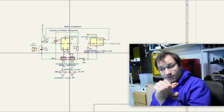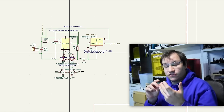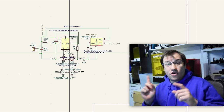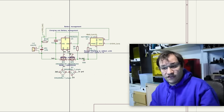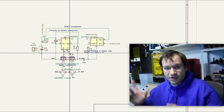The charging circuit is the same one we've used in countless other designs because I know how to build it, I've got the parts, I know how to troubleshoot it — a proven working design. It protects the battery, charges it, and knows when to stop charging and when to stop discharging. Each of these cells is individually managed, which means if something goes wrong with one cell, the unit is still functional and the other cells can take over — with no blowing up involved.